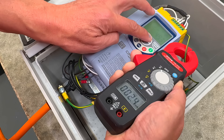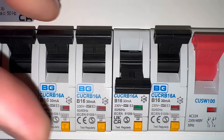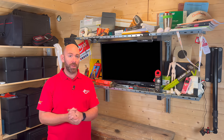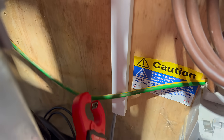So is the guidance really suggesting this isn't such a big deal? After all, DC current would only have to be present at the circuit at the exact moment an earth fault occurs and the RCD is expected to trip. Are we blowing this out of proportion? Well, I keep coming back to that phrase — making an engineering judgment. And for me, that means I'll be testing for DC current. Why wouldn't I? It's quick, it's simple, and for peace of mind, why take the risk?